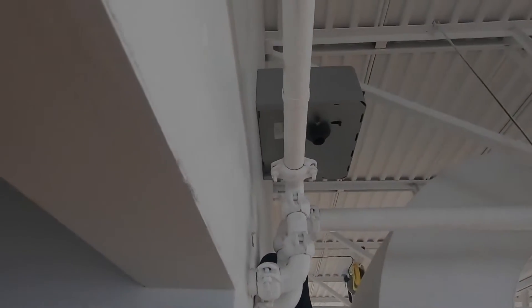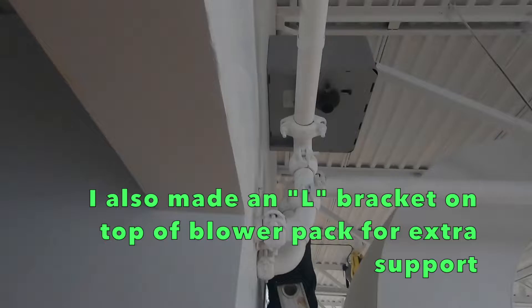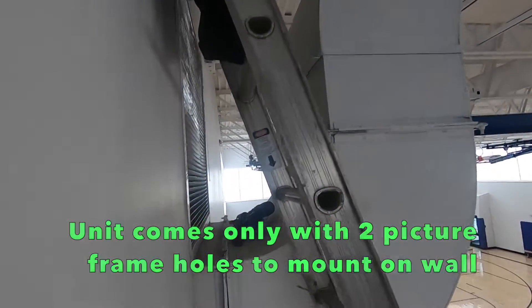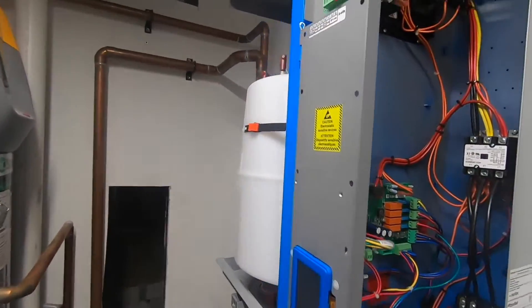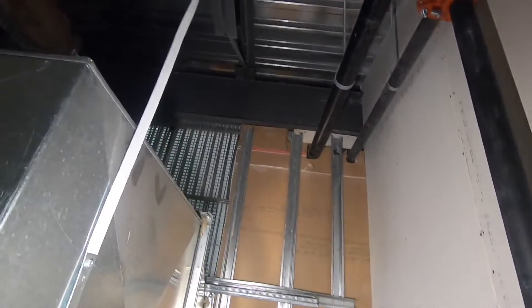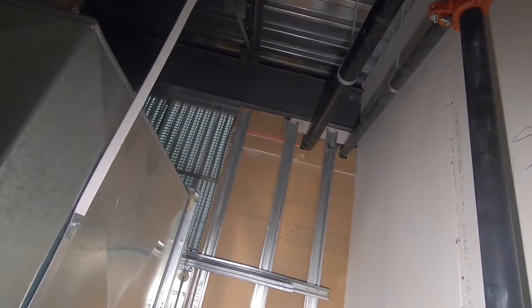So I'm on top here — there's my unit right there. I anchored it on the wall and I also made an S-cleat L at the top of it and secured it with more anchors. I don't trust just two anchors. That's the humidifier EL series Nortec. I made a hole already on the other side right between those two pipes, so I'm going to make a hole on this side two inches lower.